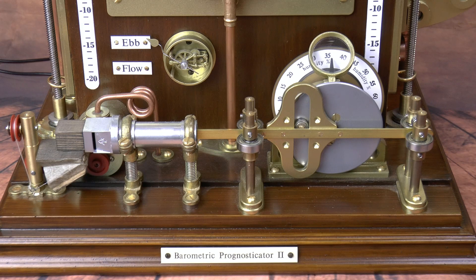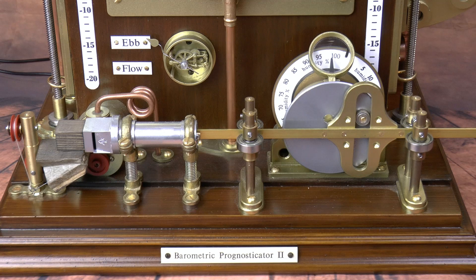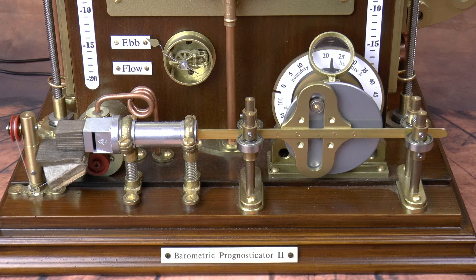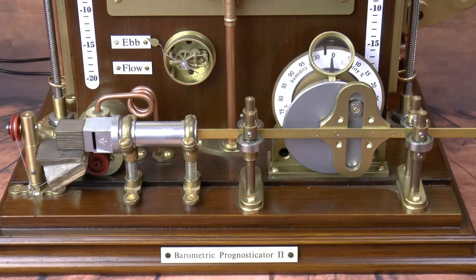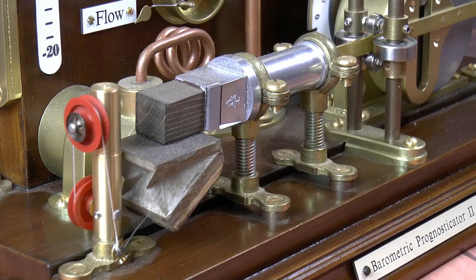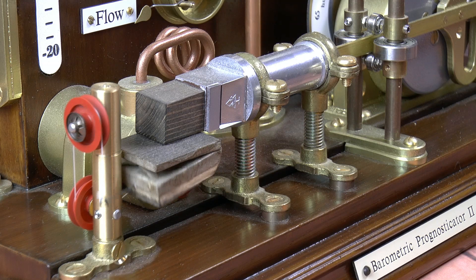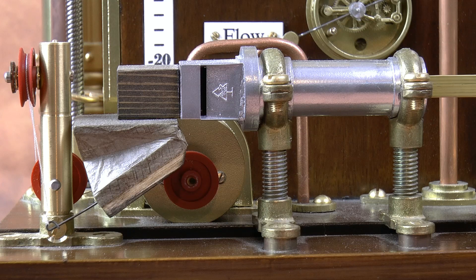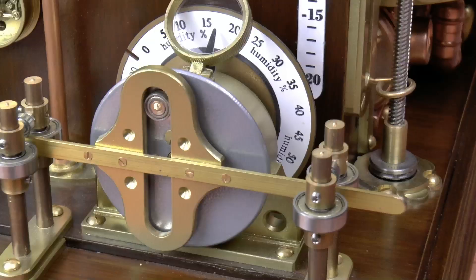On to barometric pressure. I decided to use the bellows from a cuckoo clock and the flute from a cuckoo clock, connected to a tube, a bit like a swanny whistle, and then having another stepper motor that would withdraw and push in — change the position of a plunger within that swanny whistle. The Arduino would calculate and record all the barometric pressure readings, calculate a weather forecast, and then could play each hour — or when required — the 24 hours of pressure readings as a tune, fitted into the notes from lowest to highest, to indicate whether the weather was getting better or worse. It's a nice, unusual touch, and it's lovely that it is actually a real sound — not recorded digitally. It is a proper flute that is working.